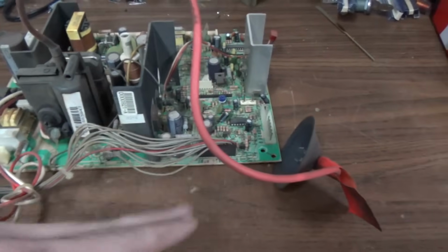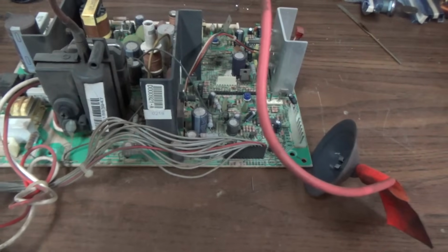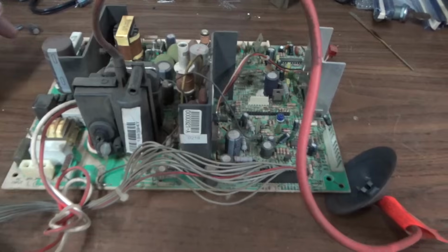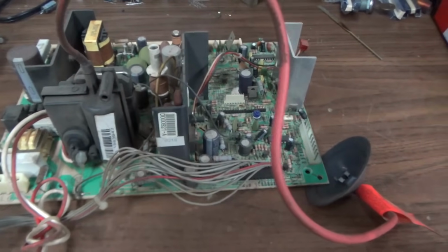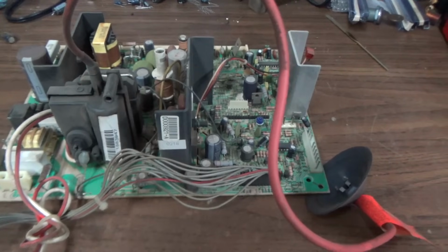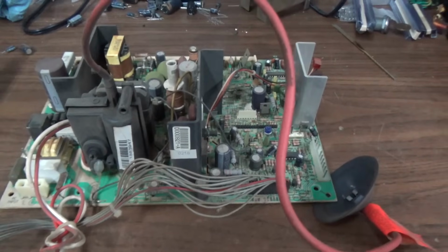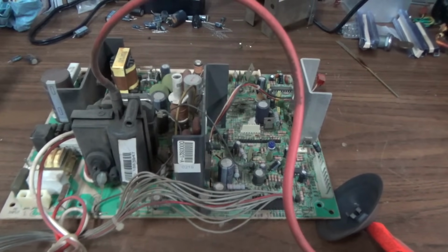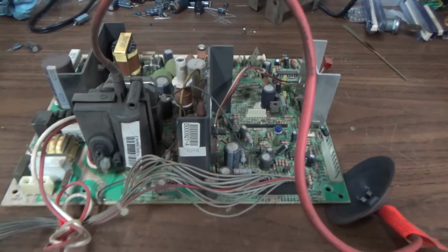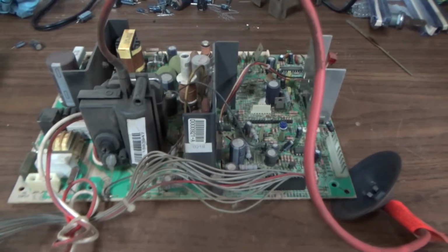And I can tell this has never had a cap kit. And that looks like the original flyback. And I've tried before. I'm not going to cap that one. It looks pretty good. I've been doing this a long time. Every time I don't cap a monitor, it comes back to bite me in the you know what. And so years ago, I just started capping all the monitors, and it really cut down on a lot of the hassle.